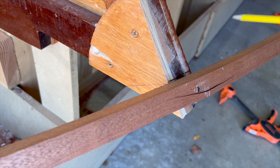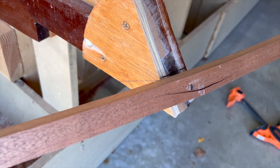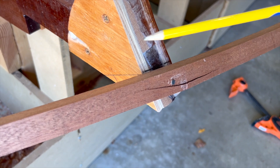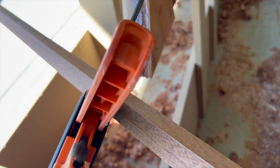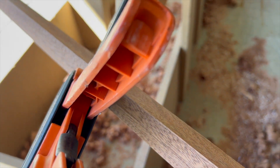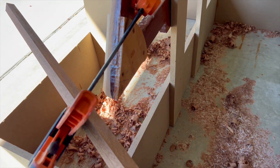The same thing is true at frame 2. I'm going to use this sheer clamp to help guide the shape — first the depth of the notches, the shape of the side of the boat — and that's how I'm going to fair the side of the boat. Once these are cut I'll put a new batten in, and I believe then there'll be less stress and I can get a batten to come through frame 1 up to the stem.